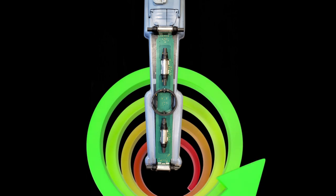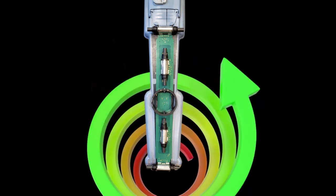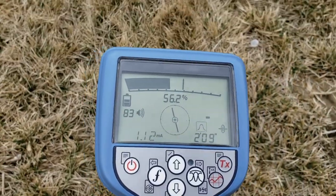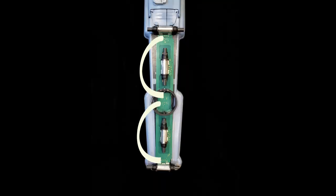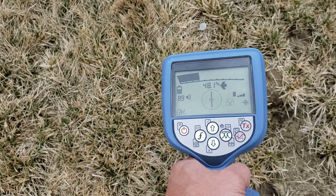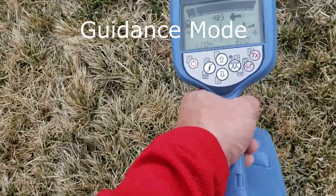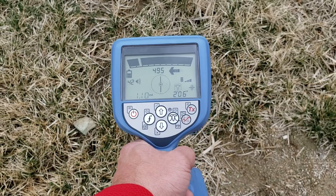A circular electromagnetic field coming to the surface above ground is wide and semi-curved, so a horizontal antenna laid horizontally will give a large peak response when it's perfectly aligned over the apex of that field — this is known as a peak response. In contrast, a vertical antenna will null out — it gets nothing when it's over the apex of the signal because it's perfectly perpendicular to it. You do get a peak response if you're to the left or right of the line, but no response directly over the target means it's completely perpendicular with no magnetic field flowing through it.